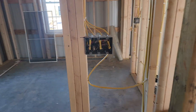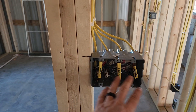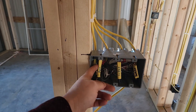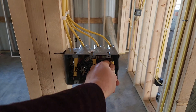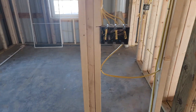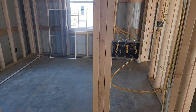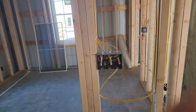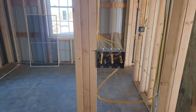The second thing you can do on a rough-in is to label the boxes — it's super important. This is a nice, clean box and they've labeled it: fan, light, vanity. Often in the back it'll be labeled power. Definitely label your switches. The trim out should be the easiest part of the job; it should be a joy for you as an electrician or the homeowner, and you want to know exactly which switches to put in each location.